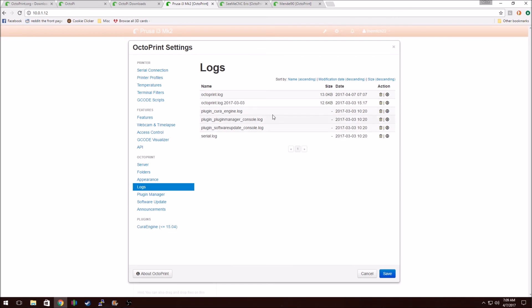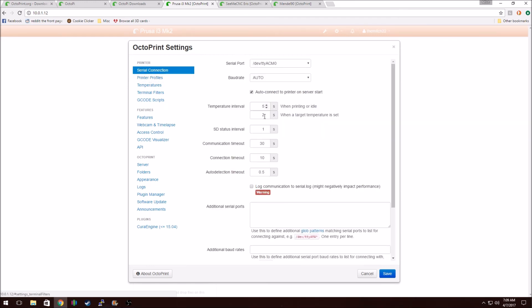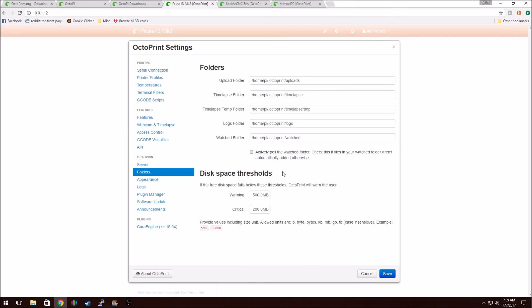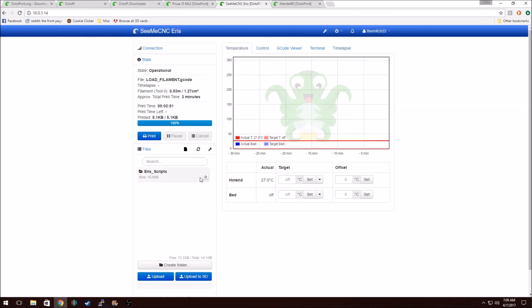There are a lot of other cool things you can do. Check logs, there's plugins — a lot of really cool plugins. You can have G-Code scripts, custom G-Code scripts. You can detect serial communication problems and change the interval and timeouts for USB. It's a really well-done package and I definitely want to support continued development of it. You can also print stuff that's already on the SD card. This is a Raspberry Pi Zero W and a Pi camera running all three of my printers.